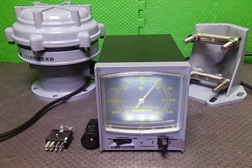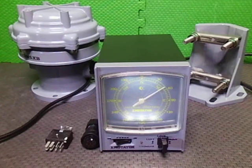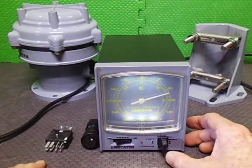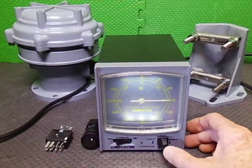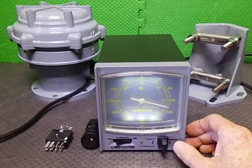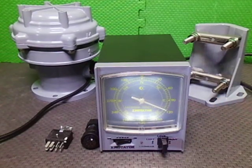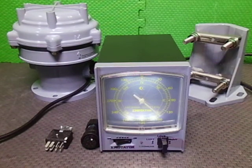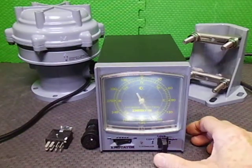They're a fairly old rotator, but this one's in pretty good condition. All I had to do was the internal chassis. I physically had to reground the bearing tracks up one size to 10mm because they had a bit of wear and a bit of ditches on the tracks. So I had a friend of mine who has a lathe, and he reground the tracks. So there we go. We'll stop in there. Let the brake engage again. And go again. So the tracks were upgraded, and we put 10mm bearings in it. So now it's upgraded. It's nice and tight. There's hardly any movement up and down or sideways. It's just right. It took a bit to get it exactly right.